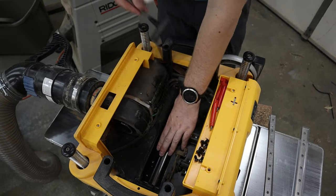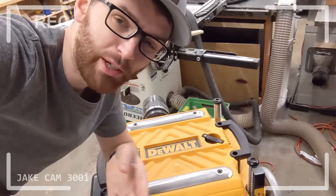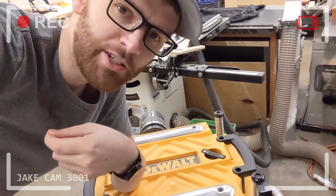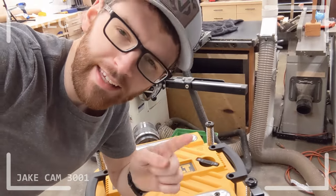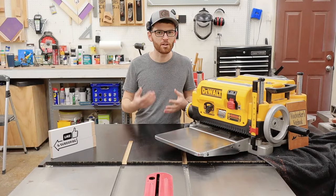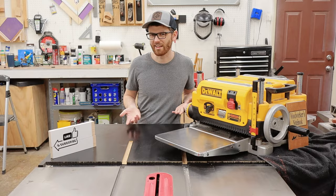These knives also have two edges so you can actually just spin them around and get back to work without replacing them if you don't want to. Extra bonus — the tool to do pretty much any maintenance on this planer is stored conveniently right here in the top. This is one of those features that engineers could have saved five minutes and just left out of the design entirely, but they were thinking ahead and it's really one of those little features that makes life a lot easier. Some of you might already be screaming that making the knives use special dowels was just a way for DeWalt to make you spend more money on the planer knives, but I'll get to that later.